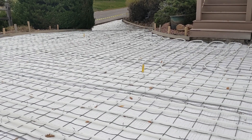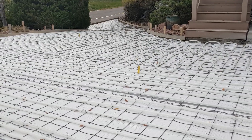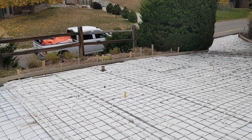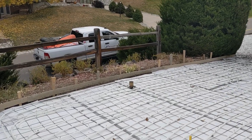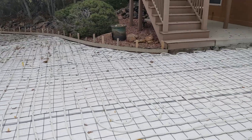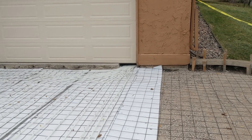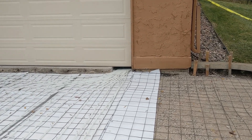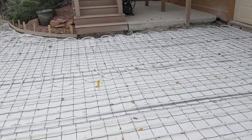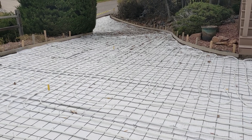We also include the Fiber Force 150 to reduce shrinkage cracks and create a less permeable surface. The automated puck over here that you see triggers the system and causes it to turn on and off. This system's also fully automated, whereas it's connected to the local weather stations and towers. So it kicks on when the system recognizes a storm front is on its way, getting the system nice and heated before we see any sort of snow — so it's ready and starts melting right away.